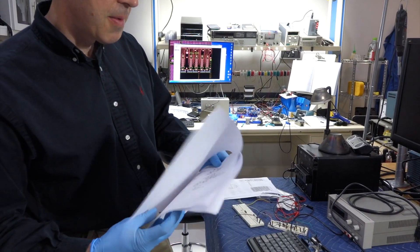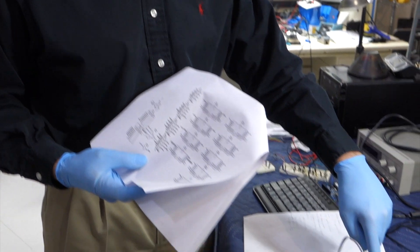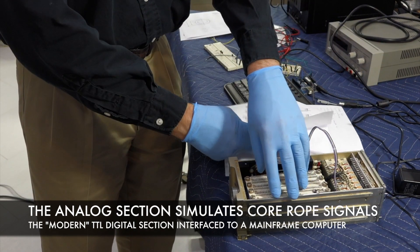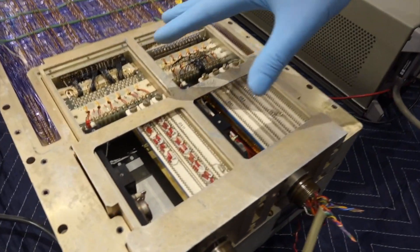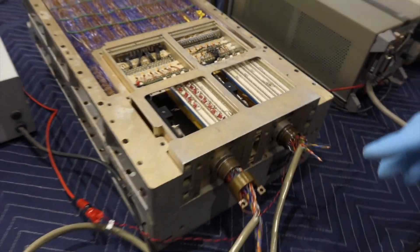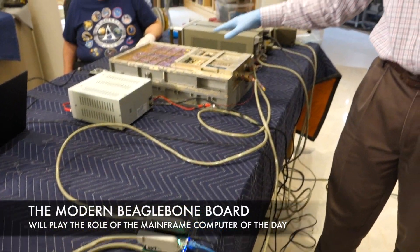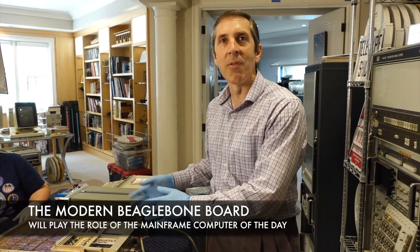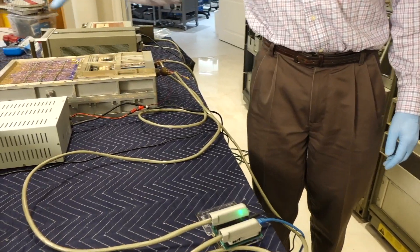It's a combination of TTL logic and some weird analog stuff. The cordwood section is the analog circuitry — pulse transformers to interface to the AGC — and then in here is digital logic, standard TTL, mostly doing address decoding. These allow us to load code from the BeagleBone word by word into the AGC as the AGC requests it. These boxes were used for ground testing so they could provide whatever test code they wanted without having to weave new ropes. I've loaded Aurora 12 onto my BeagleBone and it should be provided through this interface to the core rope boxes to the AGC.